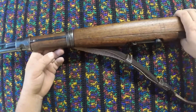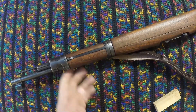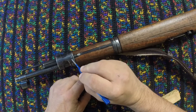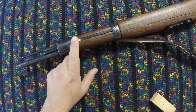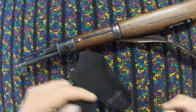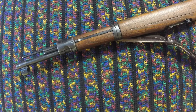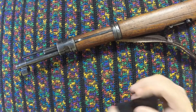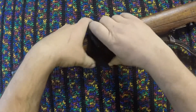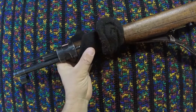We're going to need to get these barrel bands off. Now this is going to get kind of interesting. As you push this down here, you'll see that bit right there will kind of go up and down. To get this off with that pushed down — I have such a hard time pushing that — so we're going to do something kind of weird here. We're going to take our piece of wood and put it in a sock. Just follow me here, guys. We'll wrap this around here, and that's going to help keep this spring from flying off because there's a lot of pressure on that spring.